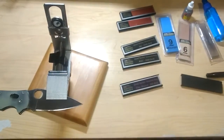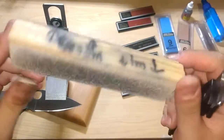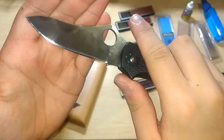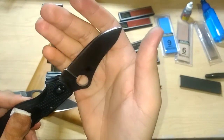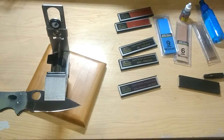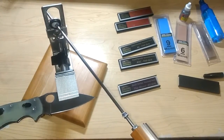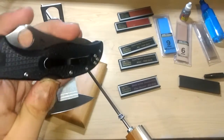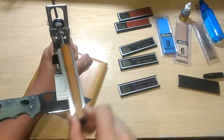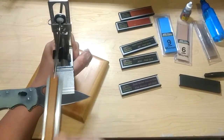But, and then I made this strop. I sanded this down, I forget what grit, but I put the 3.5 micron and 1 micron paste on here from the Wicked Edge, that the Wicked Edge sells. And I mean, this knife has a great polish. Not a flawless mirror, but it bites so hard and it whittles hairs just about. I'm pretty sure that knife right there is my Stretch. It has the shallowest angle out of any knife I have, I think. And it has the very, very, very sharpest edge out of any knife I've ever had, I think. I think it's the sharpest edge I've ever handled.